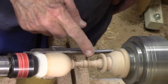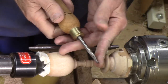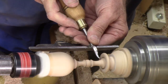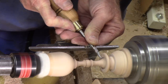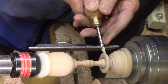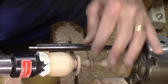I'm going to go ahead and sand this up before we free that ring. I'm going to switch to a tool I call a cat's claw — it's made out of quarter-inch high speed steel bar, filed flat on both sides and sharpened so the inside and tip cut. We keep it flat, turn it down just a little, and slowly cut in from both sides. And there we go — there's our ring. We can tape it off while we finish, or just let it dance around; it's not going to cause a problem.